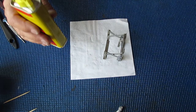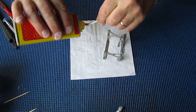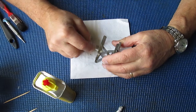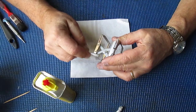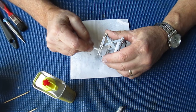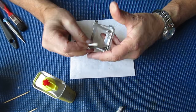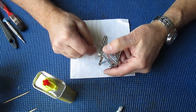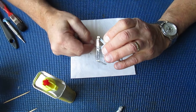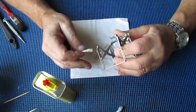Doesn't require a great deal of extra skill. So the struts. Generally speaking, on the struts there will be grease. There needs to be grease because they don't work well dry. The grease over the fullness of time will have gathered up all manner of dirt and grit, and that all needs to be cleaned away.